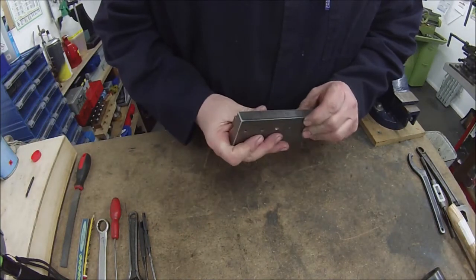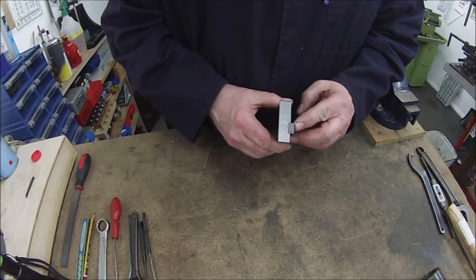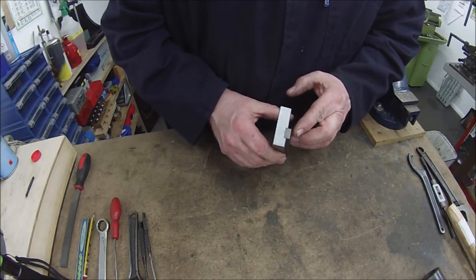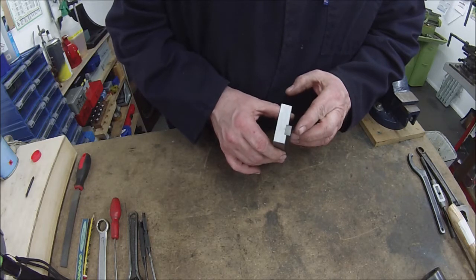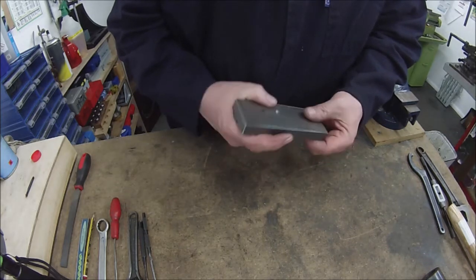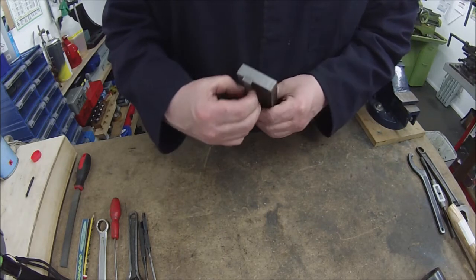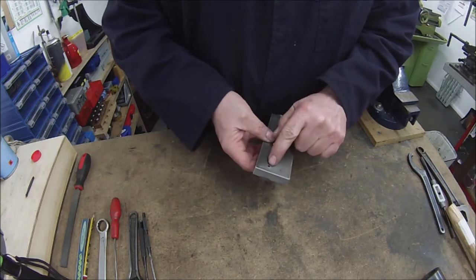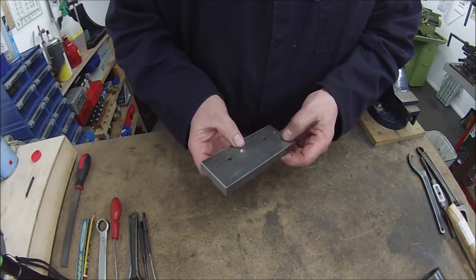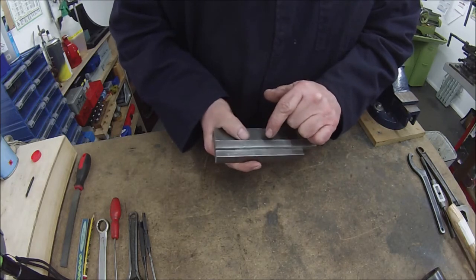The piece of that I'm using for the key steel I've milled down to a slightly thinner size so that the T slot in the tool and cutter grinder would have ended there, so we've got a little bit of clamping space. And we'll have this set up now back in the vise, clamp it by that part of the key steel, and then transfer through on them bolt holes, and we'll get some clearance holes in them. And I think I'm going to put countersunk Allen screws in from this side.